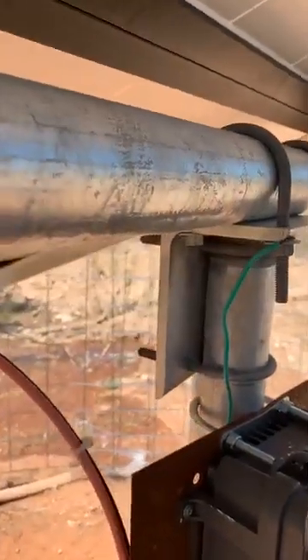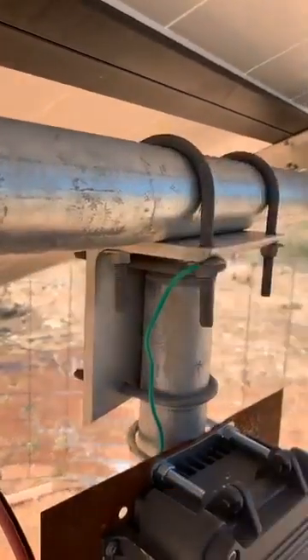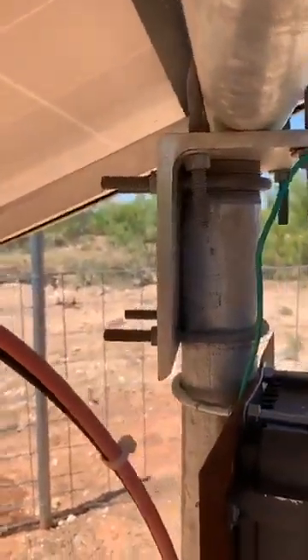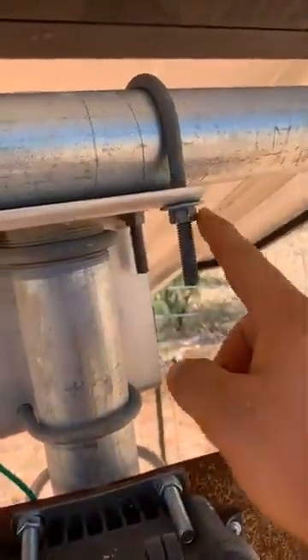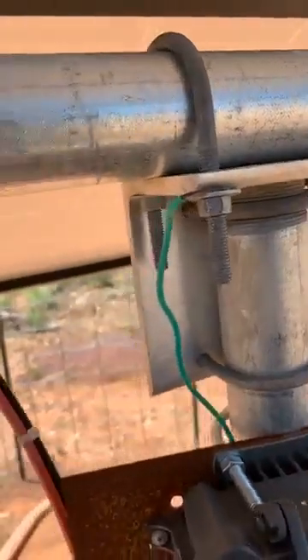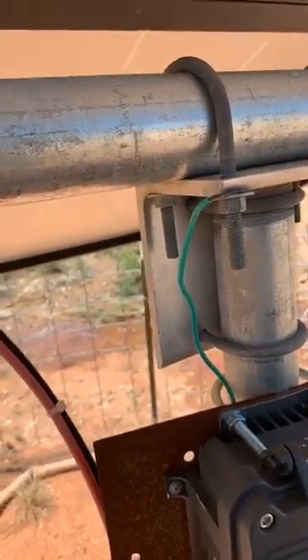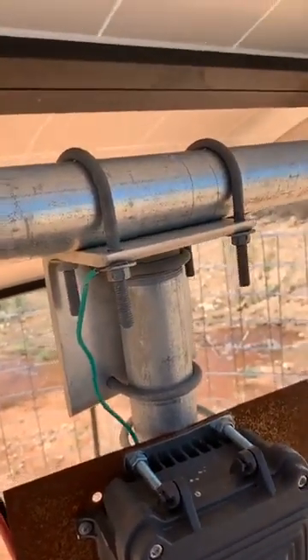I have a large piece of five-inch angle aluminum — a spare piece I had laying around. I use those exhaust brackets right there on top, and on the other side you can see the nuts. Very easy to adjust: just loosen two of these nuts on one side and one on the other, and you can tilt and angle it. In wintertime the sun's more at the horizon, in summertime it's straight up and down.